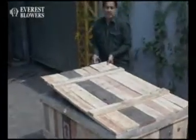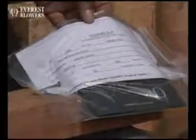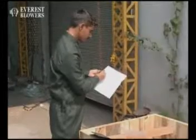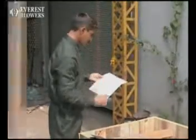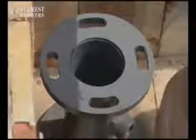The first thing to be done once you receive your shipment is to look for a packing slip, GA drawing and maintenance manual CD. Typically, a packing slip looks like this. Cross-check whether all the items mentioned in the packing slip have been received or not. Watch out for the smaller components more carefully.